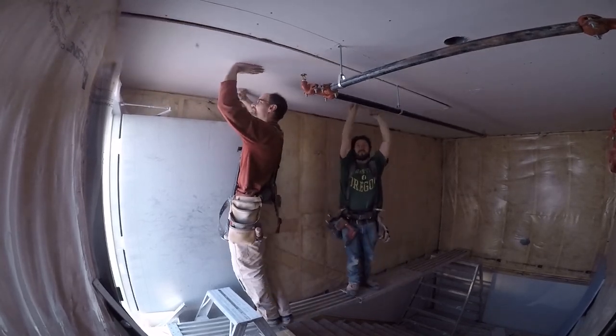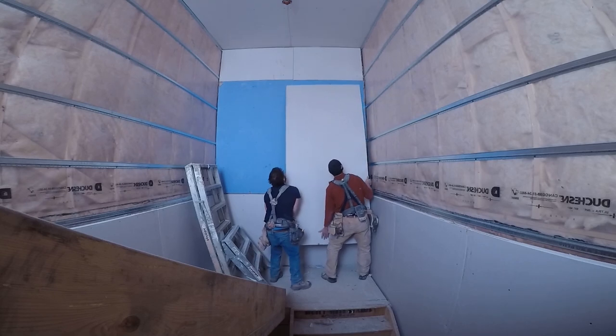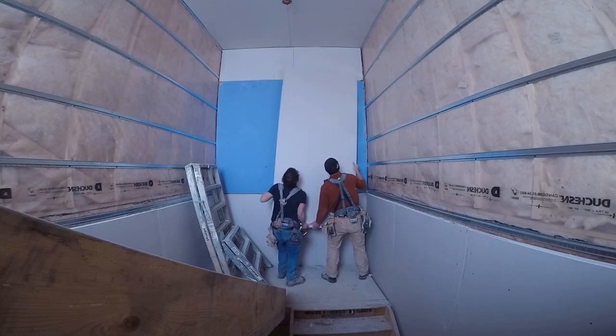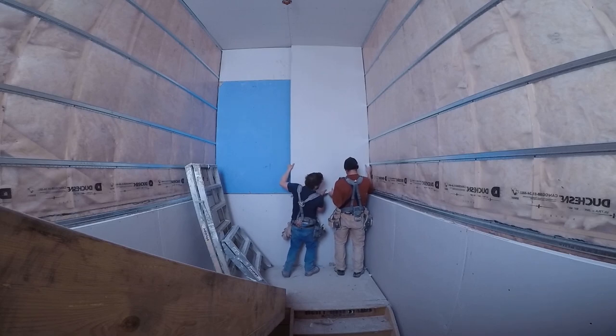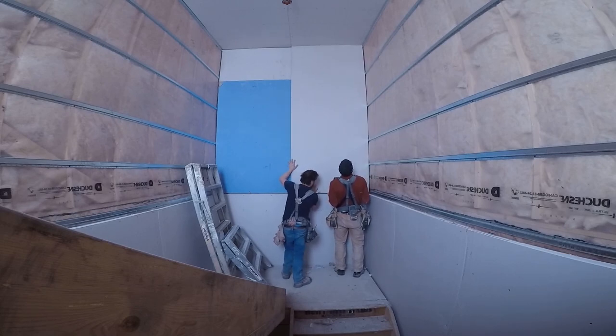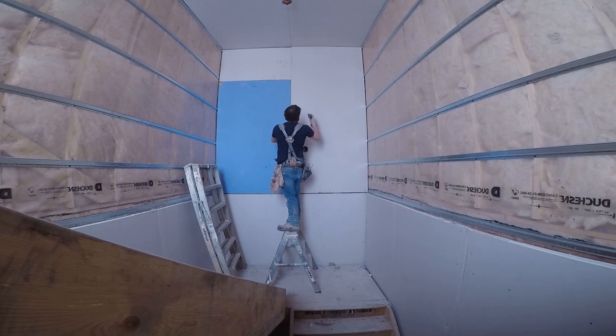This is double layer on soundbar within a three-quarter inch expansion joint all the way around. When I drywalled the first layer, the bottom, I lasered it in and made it as nice as I could. When sheets are that heavy, work together with your partner — don't be a superhero and work on your own.